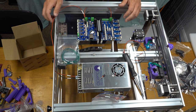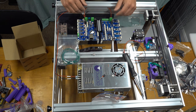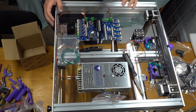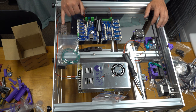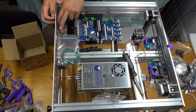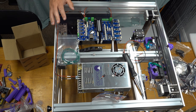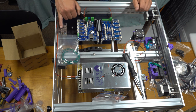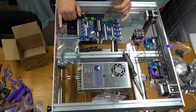Red is connected to all positives, black to all negatives. This unit here is a solid-state relay for powering the heated bed — the controller sends a DC input signal to switch AC power through to the bed. The bed is rated for AC power, and this relay is rated for up to 240V at 10 amps, which at 110V is just over 1000 watts. The bed is rated for 800 watts, so the relay capacity is fine.